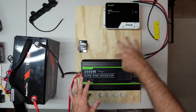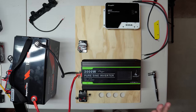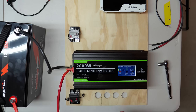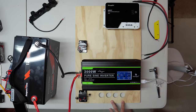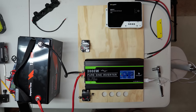Before doing my cable terminations, I wanted to go ahead and directly wire the battery to the inverter without the fuses, just to test the inverter since it's brand new and I haven't tested it before. Let me get this plastic off — it's shiny and new. Let's turn this thing on and hopefully we don't see any sparks. Cool — there's actually a color display. We've got 13 volts DC in and we're outputting 111 volts AC out. I've got a floor fan here — let me plug it in and see if it fires up. Yep — I'm assuming you can hear that. We know the inverter works, so I'm going to take these wires back off and do the proper wire terminations as originally planned.